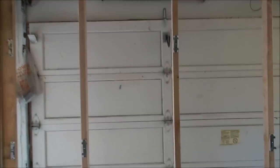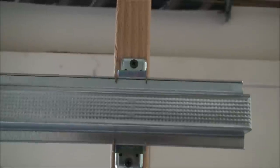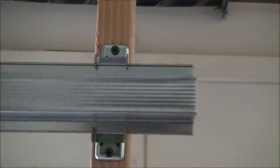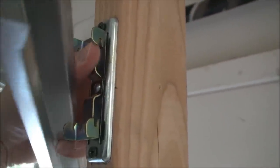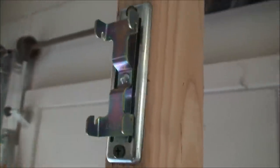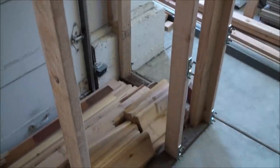We've also put up all of the quiet clips here, ready for the channel to go in. Here's a little piece of channel — let's see how this goes in here. That little guy goes there, snaps right in. I'll obviously use a longer piece than this, but that's how it works. The drywall fastens onto this. As you can see, these things have a little spring to them, plus the top and the bottom also have a little spring, so the drywall can bounce a little bit and absorb the sound.